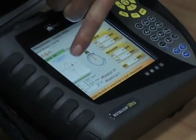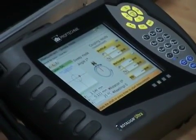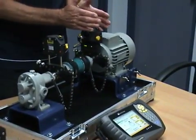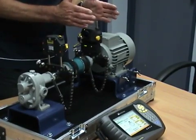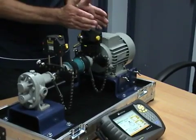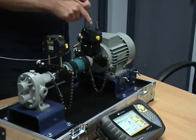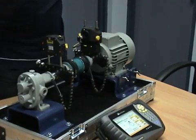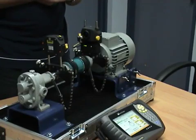We've got a red dot at the edge of the screen. To explain a bit more: we've got a laser that's reasonably dumb, and two detector planes located in our receiver. Optically they're 150 millimeters apart. The laser is going to hit somewhere on detector plane one and somewhere on detector plane two. Based on that, when we rotate the shafts, it's going to work out both the offset and the angularity of the shafts.